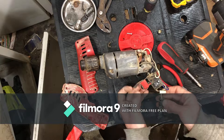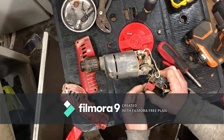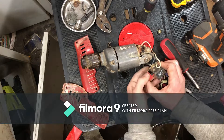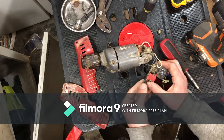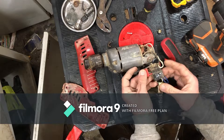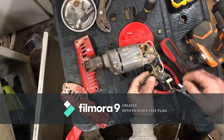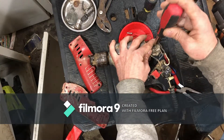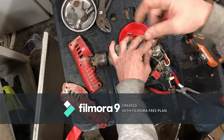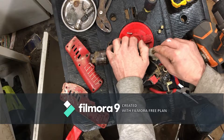That holds the wire. Just a wiper in there - there's no detent, no actual default switch. Got a lock mechanism, got your forward and reverse. We can't get this switch assembly apart here, so when we get that other handle off we're gonna pull out our bottom brush. Strangely enough, they put the brushes on the top and the bottom - I don't understand why they wouldn't put them on the sides, but there may have been a good reason for it.